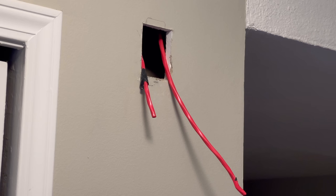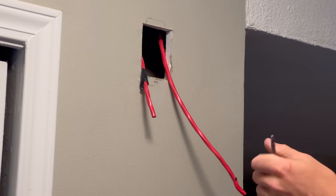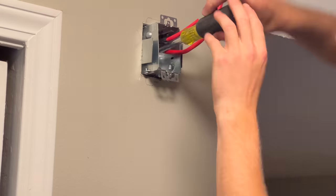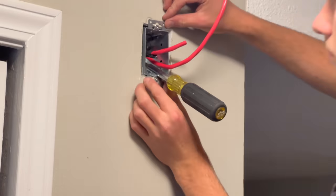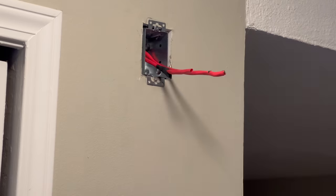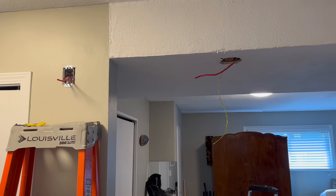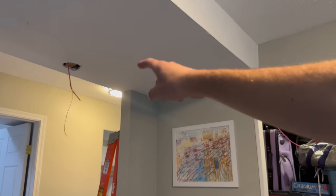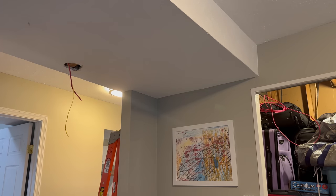All right, I'm gonna enter these into our box here. Okay, so where we're at now is the NAC is complete, as far as adding anything in the future, but that's later. So NAC is here, NAC's back to the panel room. So SLC is from the panel room, and SLC is complete up to this closet, where it needs to get ran to the front door pull station, as well as the SLC needs to get continued from this device to the front door pull station. So I'm gonna try and get a fish tape from this box through this duct area over to there so I can pull my wire through.